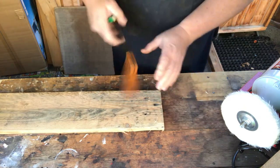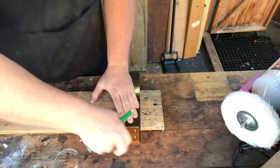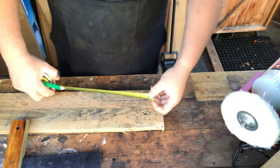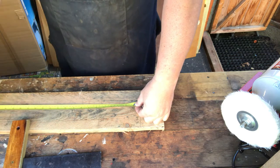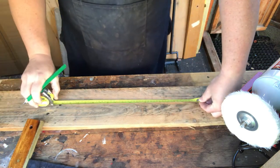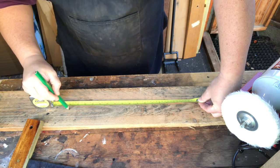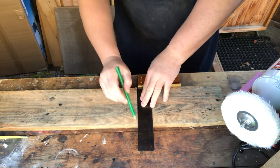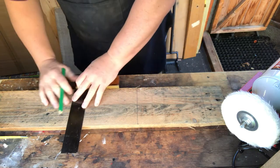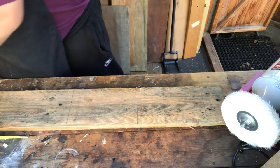We're gonna lose the nail holes, as I said. So let's mark it up here. Nine inches there. 18 inches. There. Two marks on. We're not using face side, face edge. I'll use the other side now. I'm using this side because it is just a pallet wood exercise. It's going to take you about an hour. And the other end.